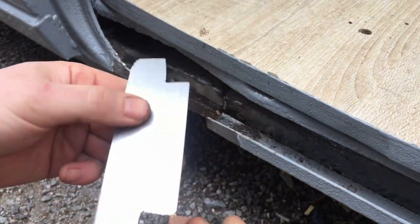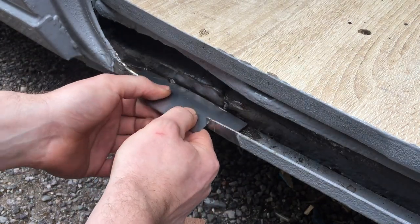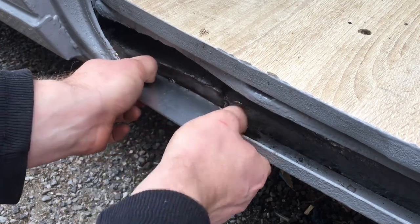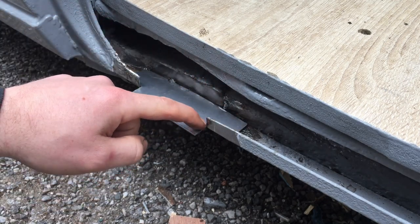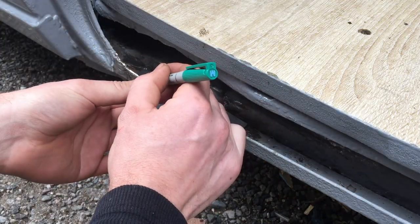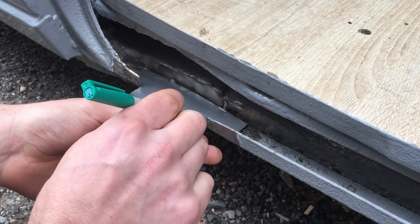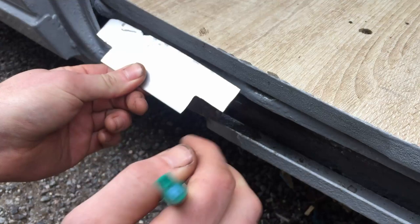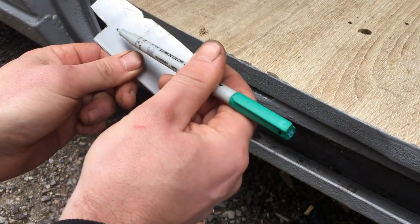After some fine adjustments — jumping out a little bit there and a little bit more off the edges — I've pretty much put this exactly into place. That fits nice and snugly on there. I've got a place to weld it on there along the back here. All I need to do now is bend this metal up so that it's flush with that, so I'm going to mark exactly where it is. Yeah, you can see that's a little bit away from the edge, so I'm going to try and bend this metal now across that line.